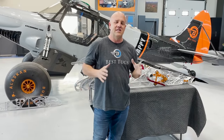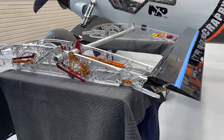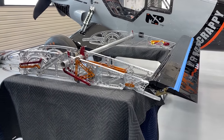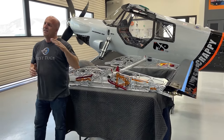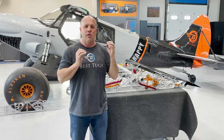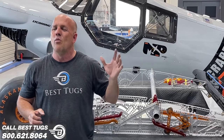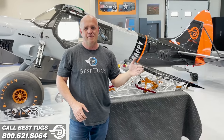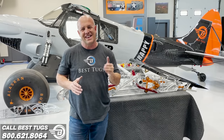Scrappy's wing is going to grow in chord, drastically alter its camber, send a hypervelocity air increase over the top of the wing to hold more laminar flow to the back of a double slotted flap at a higher angle of attack than any wing I have tested, slatted, VG, or other. All of that we want to do simultaneously while having a flap and a drooping aileron all happening at once so the pilot workload doesn't get too high.